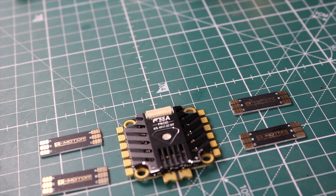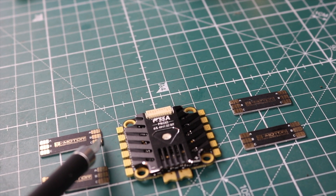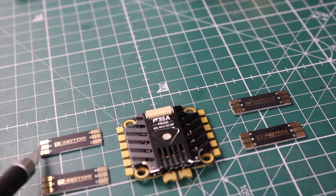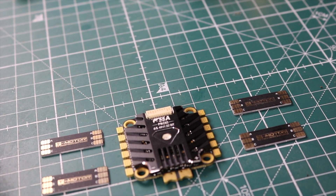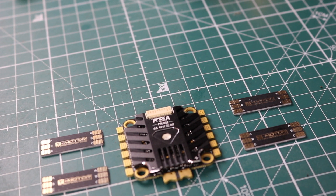They even give you race wires — what I refer to as race wires — which are these connectors. Your wires come from the ESC hooked to these, then your motor wires solder to these, so it makes it really easy to change out a motor if you destroy one, like I do almost daily. You don't have to pop the lid on your quad or dissect it; these stay in place and you just detach your motor wires. It makes switching motors really fast and simple.